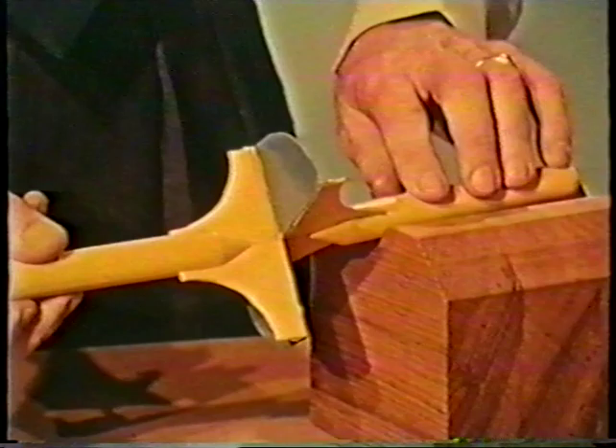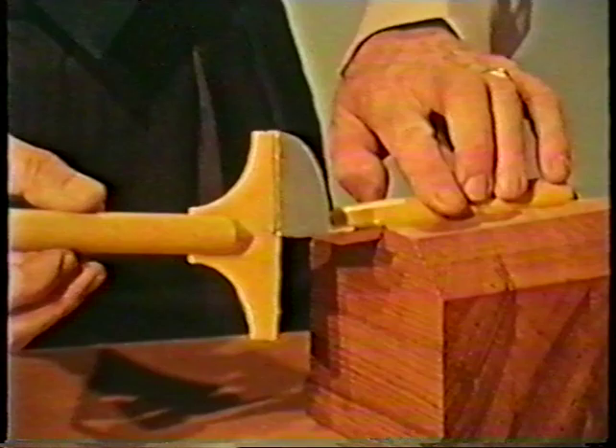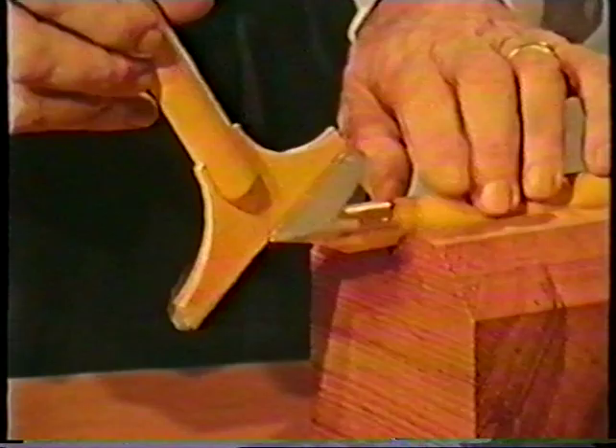The coupling constrains the shafts to intersect at its centre and the shafts have two degrees of freedom relative to one another: rotation about one hinge and rotation about the other. When the shafts are in line, they always rotate at exactly the same speed. But when they're angled to one another, the speed ratio is no longer always equal to one. It fluctuates through two cycles in each revolution, and the greater the angle, the greater the speed fluctuation and the more the wobble in the central plane.